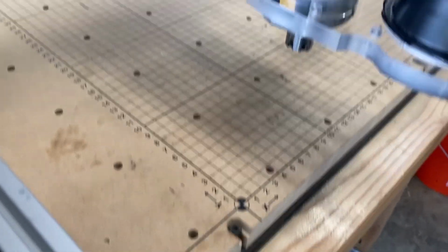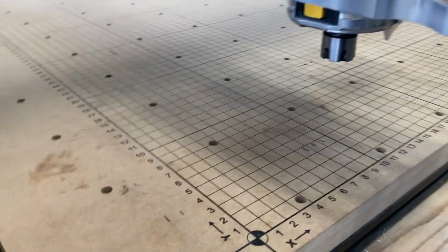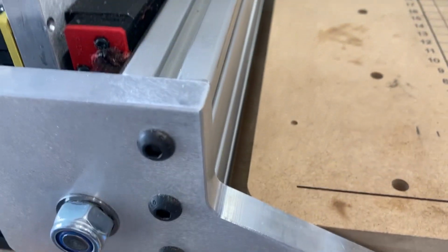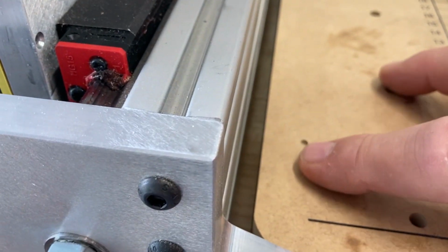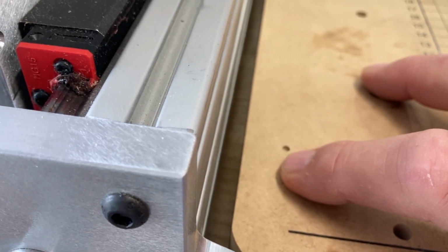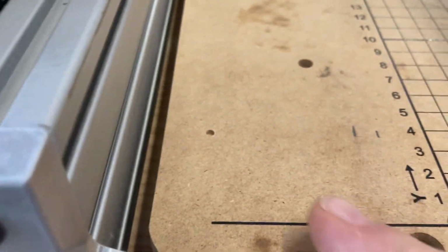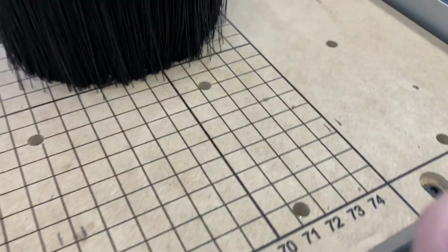And so yesterday I put a 1/8 inch drill bit into my spindle, and I homed the machine and lowered it down until it would drill a hole. And so that is the actual home position after doing the CNC4Newbie upgrade. And then I brought the machine all the way over X-wise to as far as I dared go without letting my laser crash into this rail if I unexpectedly leave it on. So I'm trying to be ultra safe.